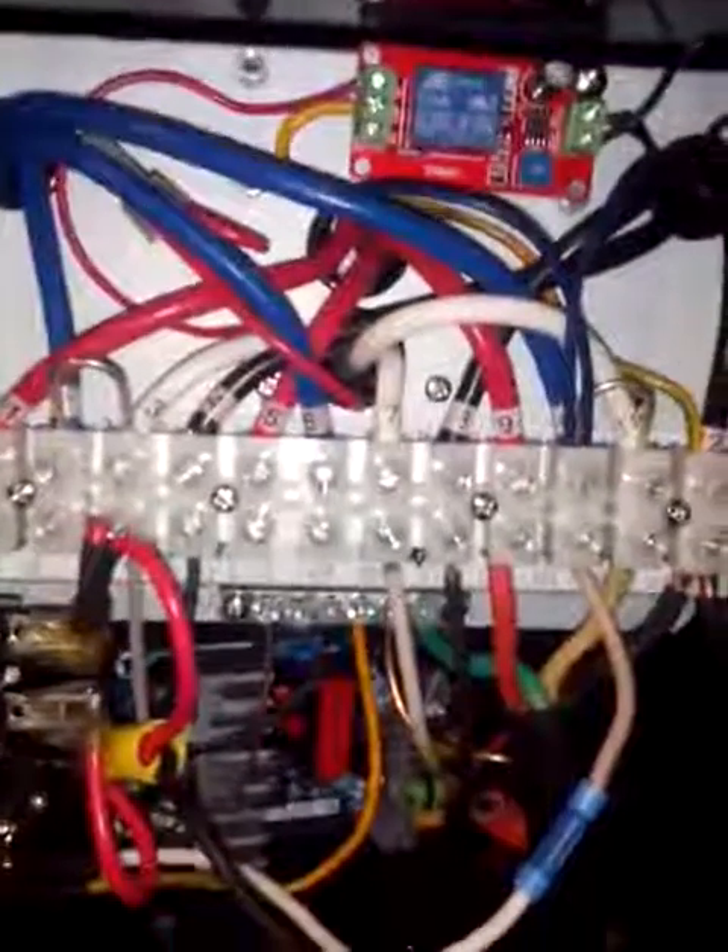When the generator is running it'll power this and then power my charger, and I can leave my inverter on. Of course the transfer switch won't transfer with this off, which has worked out pretty well. If I want to take the load off the inverter and let the batteries charge faster, all I've got to do is flip that switch right there.